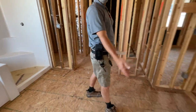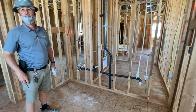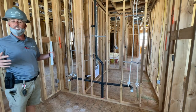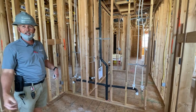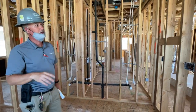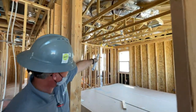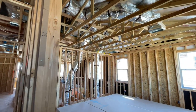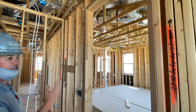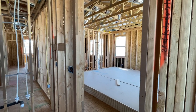Awesome. So does that have to do with how insulated the house is and all that stuff? Absolutely. How tight the house actually is on leakage. The houses are so tight on leakage now that's why we're putting in those jump vents to go from the bedrooms to the hallways. There's a jump vent in the master sitting off in the corner. It looks like a big air conditioning vent, but it's just a hole that goes over the stairs. So that when you're in here with your door shut, you're circulating that air through the house, because there's not as much leakage air coming in from the outside. You need to blend it with your fans and your air conditioning at home.